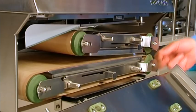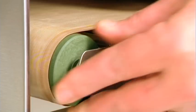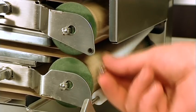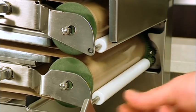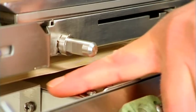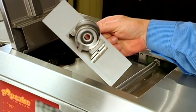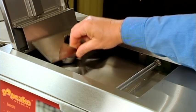Check that the Teflon coated belts are inserted correctly and the rollers turn without resistance. The white rollers at the right hand side of the machine are clipped into their operational position. The crumb tray is sitting in its correct position. The baffle plate is in position and the splash guard inside the bag chamber is in place.